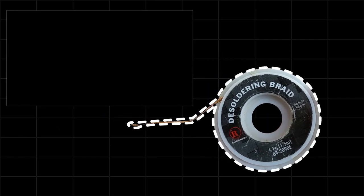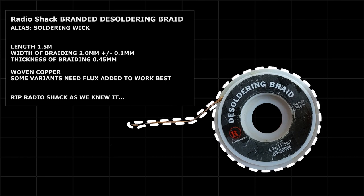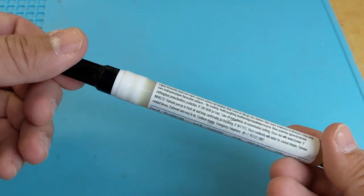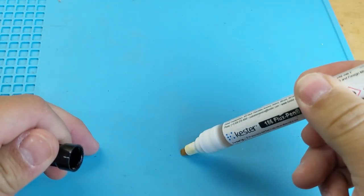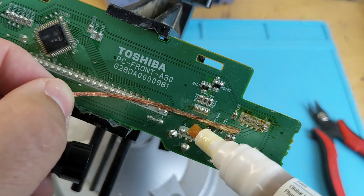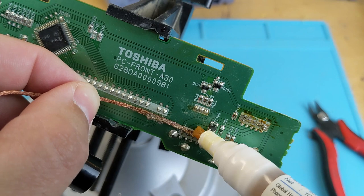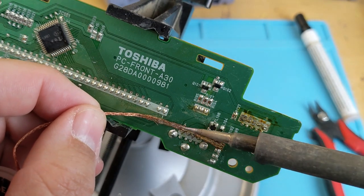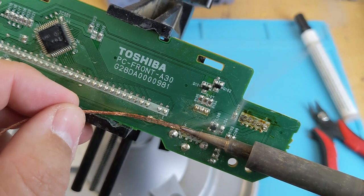The other alternative to a solder sucker is a desoldering braid or solder wick. These are made from woven copper and solder flows into it like a sponge. Take note that some wicks have flux already and some don't. Flux is a magical substance available as either a paste or a pen — depressing the tip allows it to flow. It basically encourages solder to flow by removing oxides from the metal; wherever heat and flux are, solder will want to go. Apply a little to both the solder wick and the joint you want to solder or desolder.